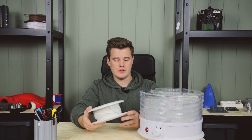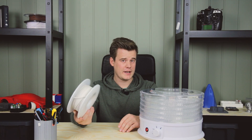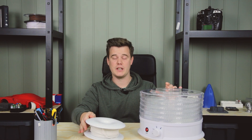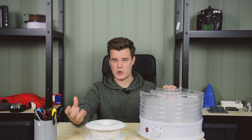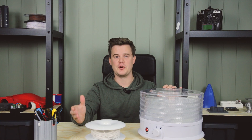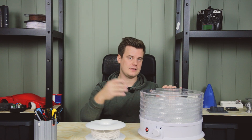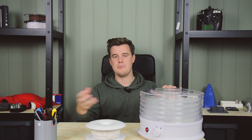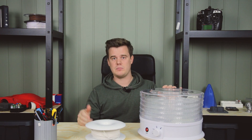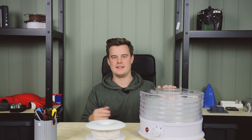If you're unsure whether you need a filament dryer — basically if you print with ABS or more technical materials like nylon, polycarbonate, or PVA — I would suggest getting a dryer because it really affects printing a lot. Nylon is a hygroscopic material that absorbs moisture and you can actually ruin a spool by the time you finish your prints. It saves a lot of your spools. Personally I use this to recover bad spools — I don't always dry before printing. If I have a new spool I'll just open and print, but when I forget it in a box for a few months I dry it and then it's easy to use again.